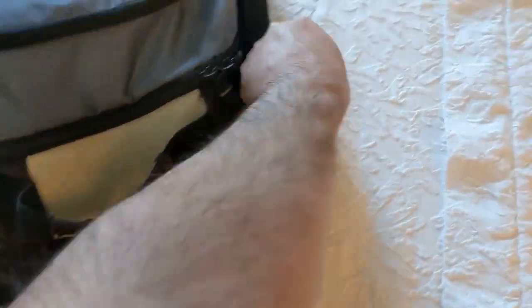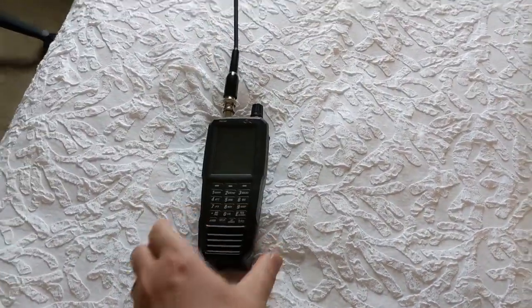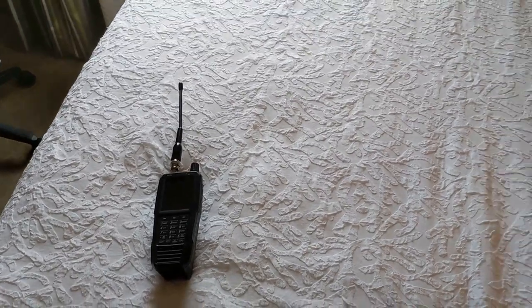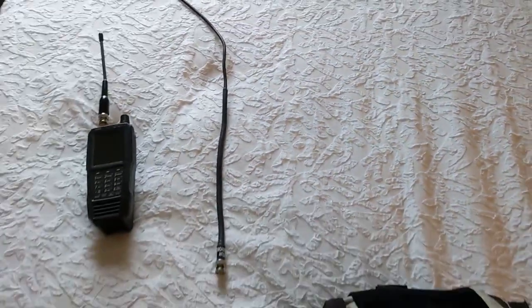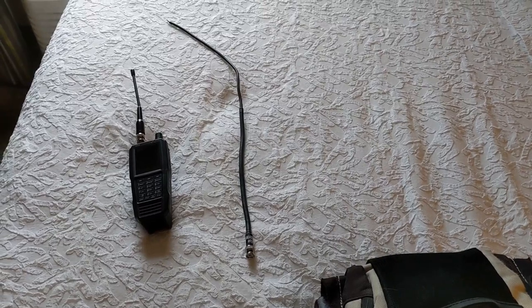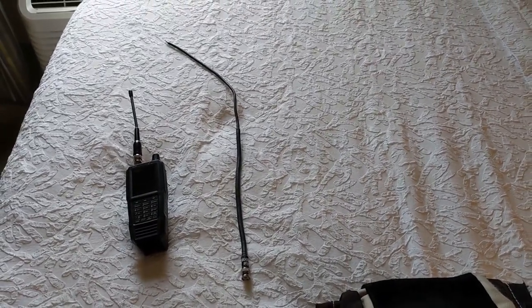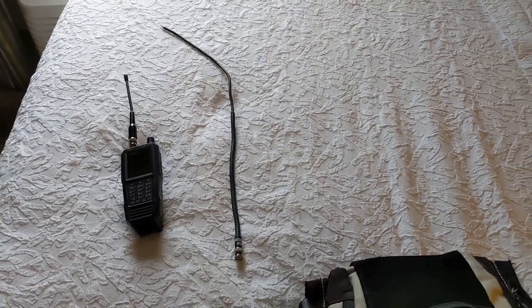Right here at the back is where we keep some of the important stuff. First out we have a Uniden SDS series radio — that's an SDS-100 with an 800MHz antenna on top. The next thing is this antenna: I like to use it when I'm traveling. This is the one that Darren Shields made from Broadsword Antennas. It's excellent for airband but works really well in VHF generally, and down here in the US there's still some VHF activity in the 150s MHz band that's interesting to monitor.